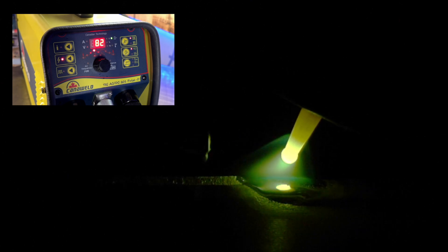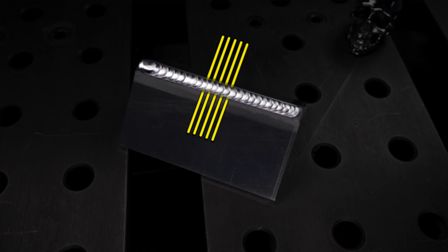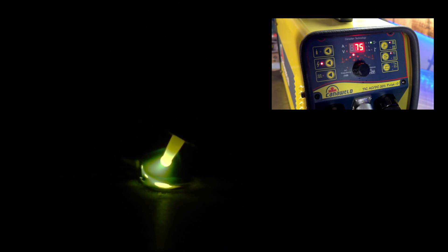As I'm moving I'm keeping up a relatively tight stepping distance. The term stepping distance refers to the distance between each step where filler material is added to the weld. I'm watching my edges carefully and want a smooth blend between the filler material and the base material — I'm going to show you a really crazy trick later in this episode about breaking down this detail.